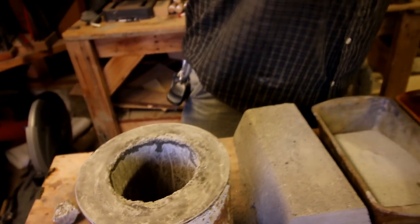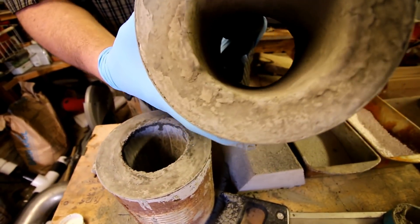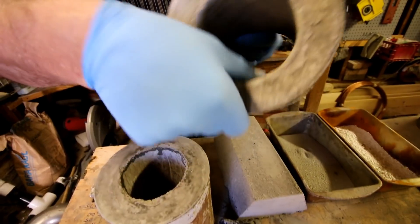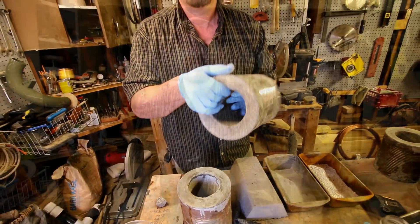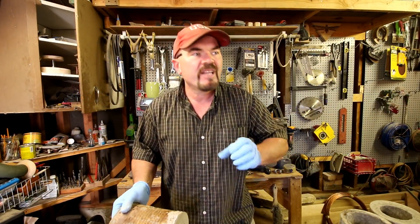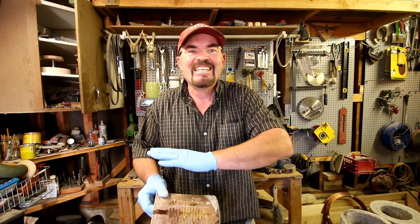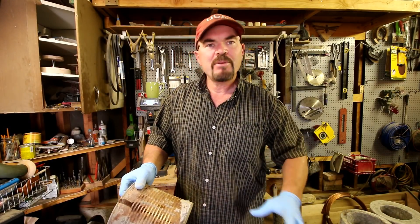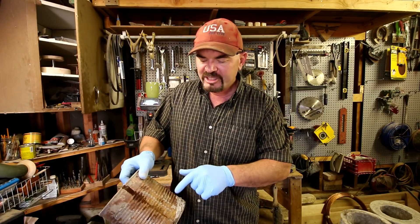After I got the rocket stove going and put this riser on it, it got hot and just sealed them. Look at the inside of that — can you see that? This has been subjected to about 1800 degrees for hours last night, with white-blue flames shooting through it. The insulative properties are insane — right above the vortex chamber where it was around 1600–1800 degrees, the most I could get on the outside of this can was 160 degrees.